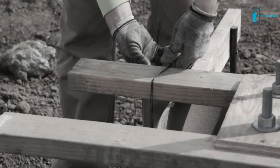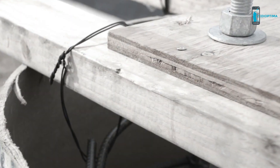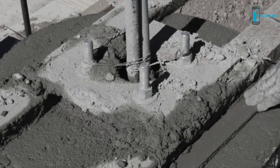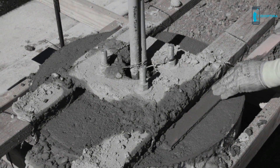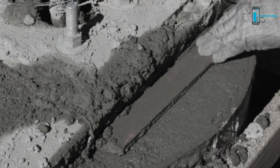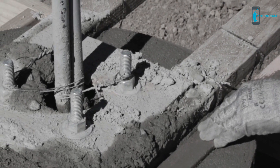For each pole base, material has to be ordered and labor is expended measuring and cutting material for the template, followed by inspection, and then the concrete pour. After the pour, it's time to trowel finish the exposed pole-based top — but stop right there. A huge inefficiency exists at this point with the conventional method. There's insufficient room to finish the entire pole-based top in one step; the conventionally built pole templates get in the way.